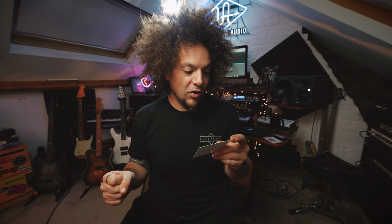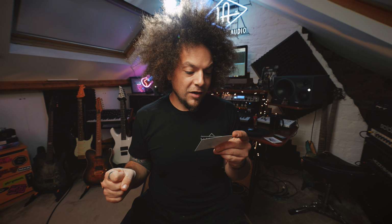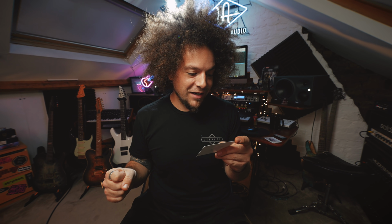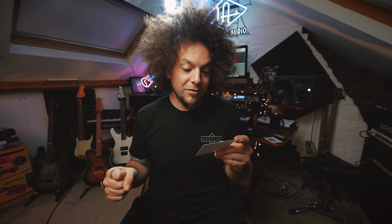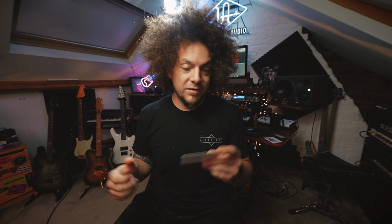EUNA features an audiophile grade signal path with no electrolytic or ceramic capacitors. The dual-stage unity amplifier circuit will restore sparkle and feel to your tone, and it's capable of driving down to 600 ohms. There are 3 filter circuits to help tailor your tone. Our custom steel chassis provides great noise rejection, and the back is easily removed for servicing and mods.